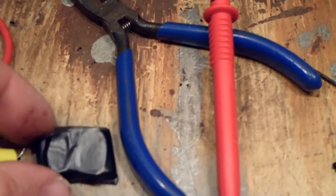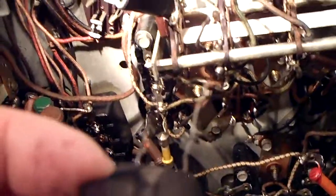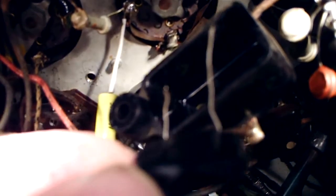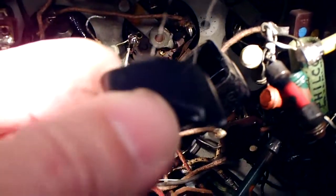I just wanted to show you that because this is pretty interesting — it's a resistive wire resistor. I guess they made it out of wire for stability, or maybe they want a little inductance in there too — a little inductance to go with the capacitor, maybe. So I'm going to reuse this rather than use another resistor, because I'm not sure whether this needs a little inductance or if they used that wire for better stability.